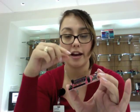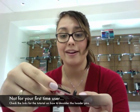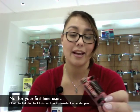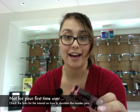Another option is to actually desolder the LaunchPad headers — take them off the LaunchPad by desoldering. If you have a rework station, or a soldering iron and some pliers and want to try it out, it is possible. It's kind of intensive — it's a lot harder to desolder than it is to solder on. But we do have a tutorial done by one of our apps engineers to help out, and you can follow that if you're interested.